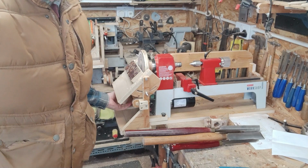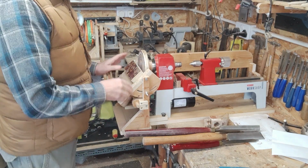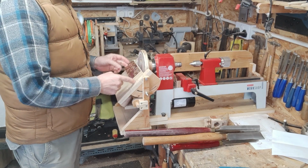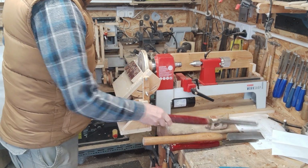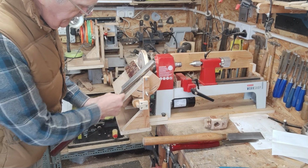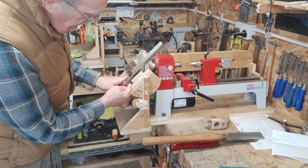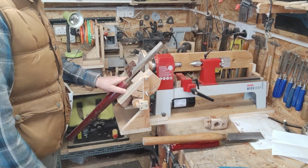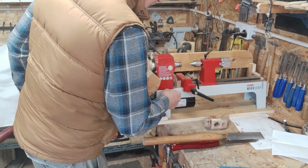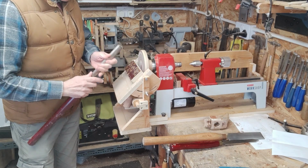I've shown you the profile grinding using a similar design to the Sorby Pro Edge. Now I've put the base back on, which can be used for normal sanding, for putting radius on things and that, but I've actually put a sub base on as well, because when you put the tool on here, you've got the ferrule which interferes with the angle. I want to be resting on there, not on the ferrule, so I've put a block of wood there that clears the ferrule from the actual sanding table. Now the beauty of this is you've got a variable speed grinding.